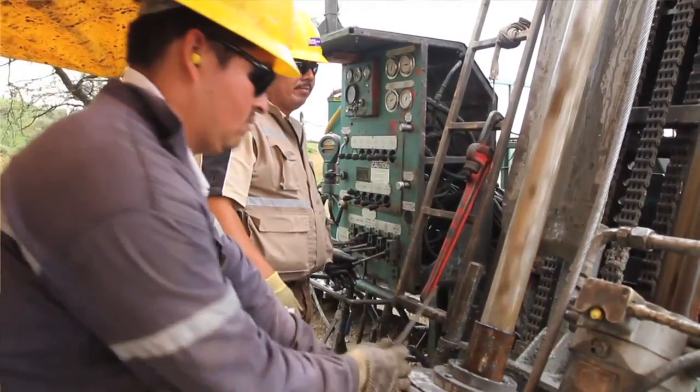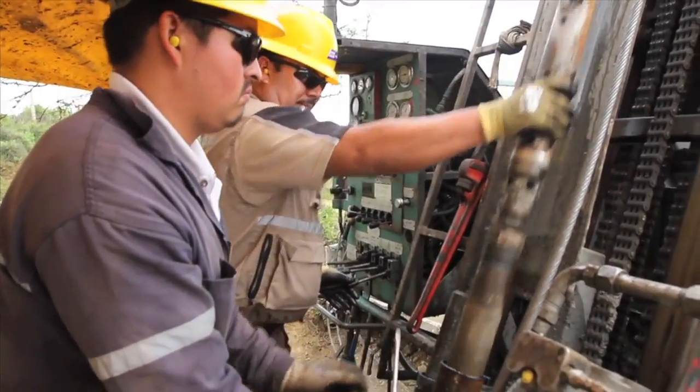There's only that little piece down at the depth that is actually filled with rock — the rest is still hollow. Say we're trying to hit a certain point but we're not making it, and that's where our evidence is that there's a body of silver. So you do what are called downhole surveys, where an instrument is sent down the hole past the end of the drill rods. Those rods are pulled up a little bit so you don't have any magnetic effect. It takes a compass reading and a dip angle. Then we put in a little wedge — a triangular piece — that creates a small deviation. If it still doesn't look like it's getting to our area, we'll put in another wedge, and keep going down and surveying, checking where it went, until we slowly get to our area.